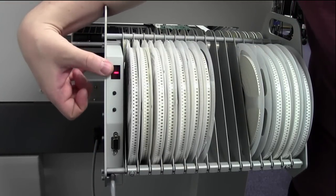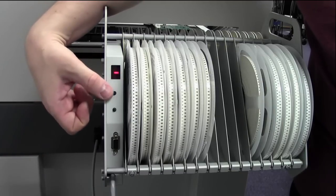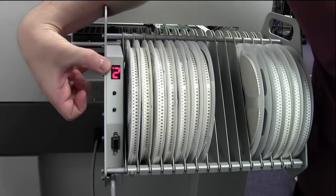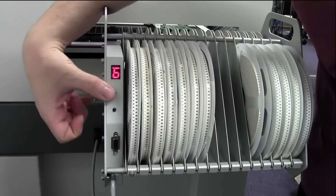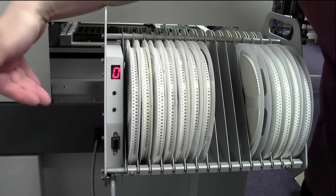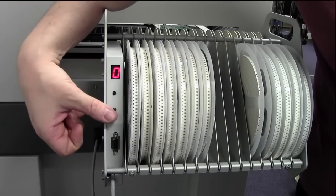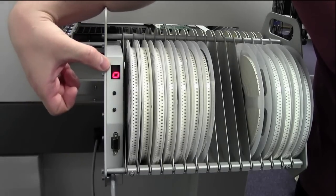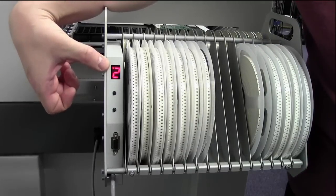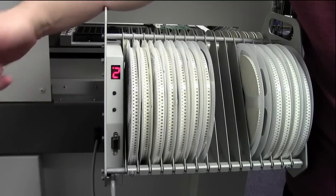If you're happy with that, you press the upper button. This takes you back into the lane menu. Cycle it through to 0, so lane and nothing, so we're out of the lanes. Lane 0 is the important one. Once you've done that, bottom button, little naught appears and it flashes on and off. That's our feed rate saved. That's how you do feed rate.